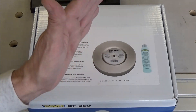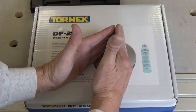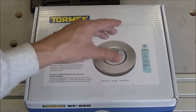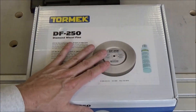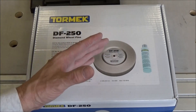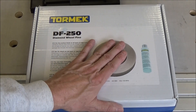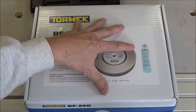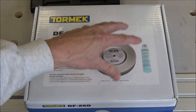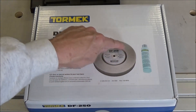I've always been a fan of when you grind an angle, keeping that angle flat — like on a chisel at 25 degrees, keeping that bevel flat. Before, I was using the wheel and you put that concave surface on it, and when you put your micro bevel on there, there's not a lot of metal behind that micro bevel. So what I plan on doing is taking all my tools — chisels, plane irons, whatever else — that need a flat bevel and doing it, because you're able to use the side of the stone here.